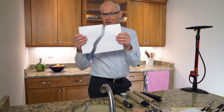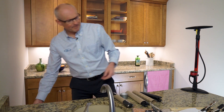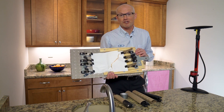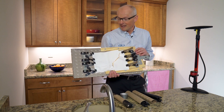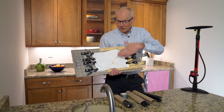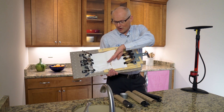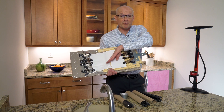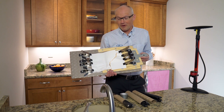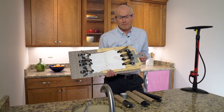You can actually see, typically in a more controlled environment in this little experimental setup, that fractures have a tendency to grow what we call perpendicular to the least principal stress — or perpendicular to the orientation in which a pulling force is applied. I've done that here in a more controlled environment where we apply a uniform pulling force over the entire piece of paper. You can see that even though the cut was at a specific orientation, the fracture growing from that pre-cut actually grows in a very different orientation, indeed perpendicular to the direction in which we pull the paper apart. That's how fractures grow.